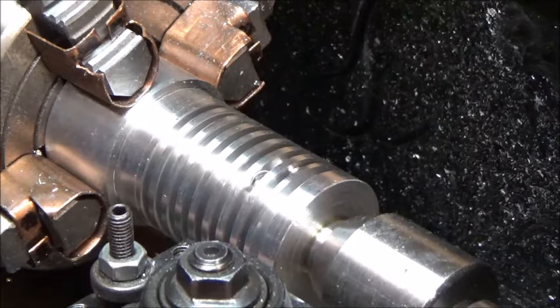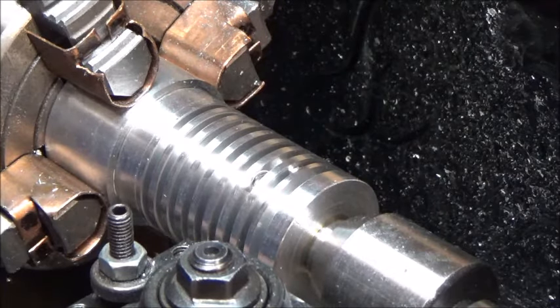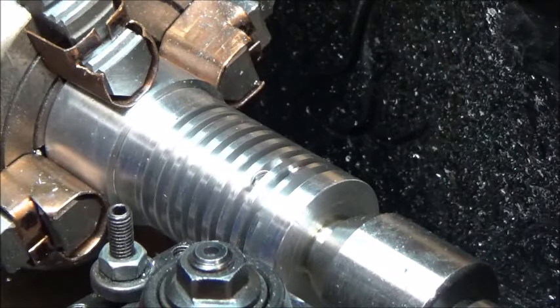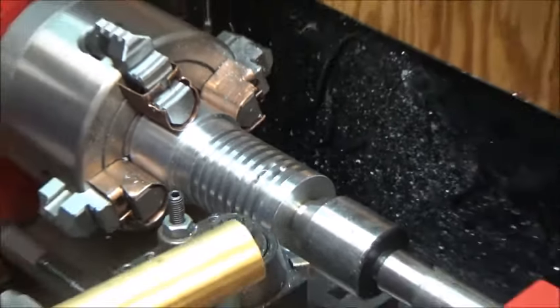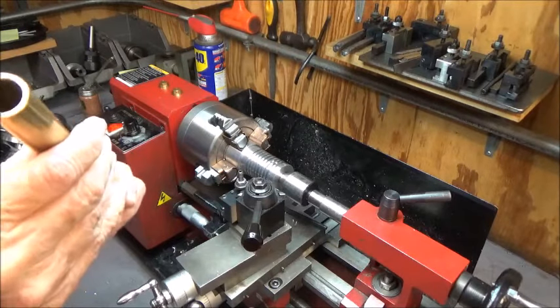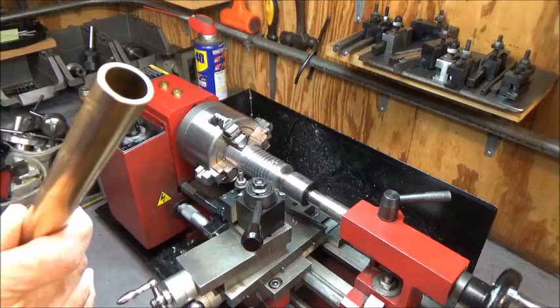We're working on the power cylinder. Like I said, we weren't going to show a lot of footage on this because it's pretty much the same as the displacer cylinder. However, there are a couple of differences I want to point out. This cylinder has a sleeve in it. I had a piece of tubing here — it's got a nice thick wall on it and a very precise interior dimension for the piston. It's 20 thousandths over the plan, so it's 620 instead of 600, but I'm sure it'll work fine. I put a piece of this in there for a sleeve.